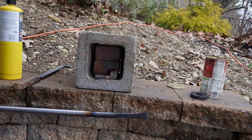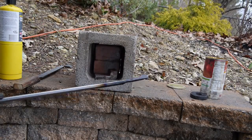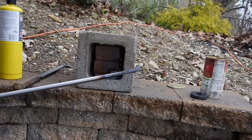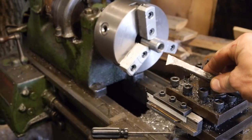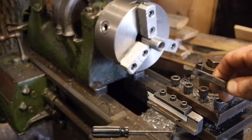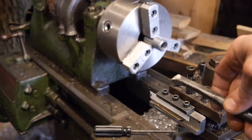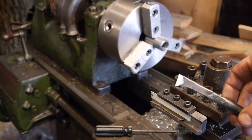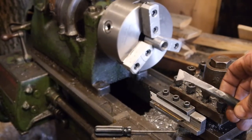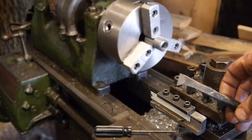Now I take it over to the grinder, put the edges on it, and we'll cut on the lathe. Oh yeah, I gotta temper it first — but we'll do that after we put the angles and stuff on it. So I got it cut, took it to the grinder, sharpened up the edges, ground away the bottom and some of the far edge so she has room to maneuver inside the bore. All that's left is to temper it in my little tempering toaster oven — temper it at 350. It'll leave it hard but give it a little more resilience, and then she's ready to cut.